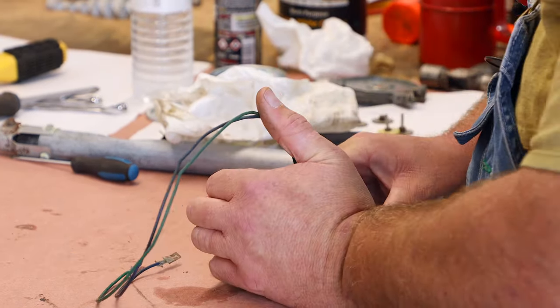Get the soldering iron on the tip. And get the wire out. So the wire is out, but we still have a blob of solder on the end of it. And let it cool off again. I'm going to heat that. And just like that, now we got an opening. Just barely heated it up and just knocked the drop of hot solder out.